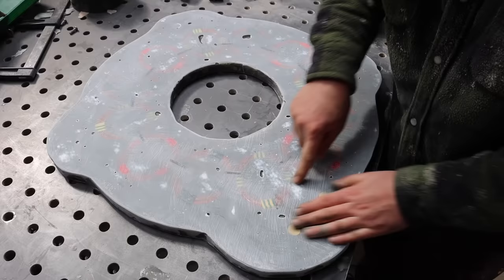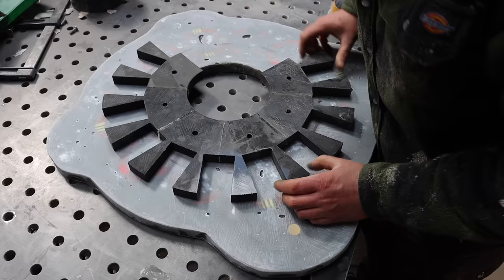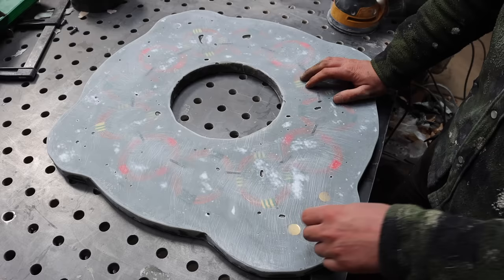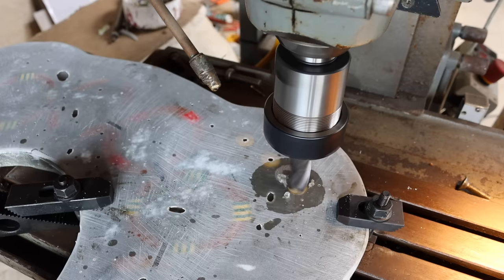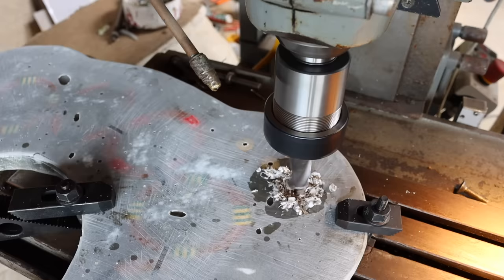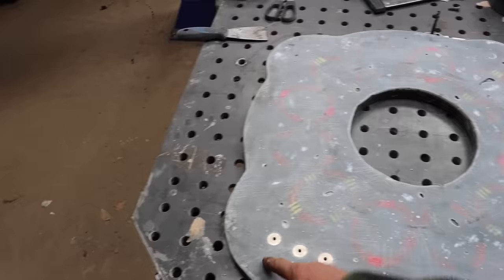I can see the coils and they line up well. So if I line up, say, the earth colour, not actually earths, line them up to the middle like that. See, they line up. Yeah, so I'm pleased with that, and that one will line up there. Came up well. My connections aren't too far away from the surface, so I'm going to end mill in nice and tidy, and I'll be able to get to them. Yeah, sorted. Stator is done. Well, just need to drill some mounting holes, but I'm going to let this set for a few more days yet.